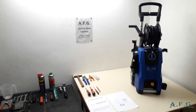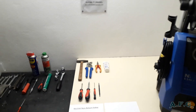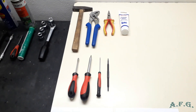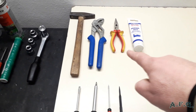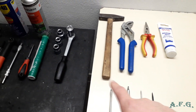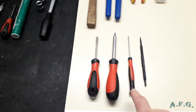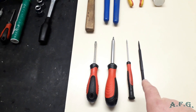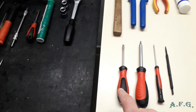Today I'll show you what instruments we will need to do the repair. We will need silicone grease, Liquid Moly, pliers, an instrument like this, maybe a little hammer, a nylon pick or thin flat screwdriver for picking up or taking out the O-rings, Torx 20 screwdriver, and a flat screwdriver.